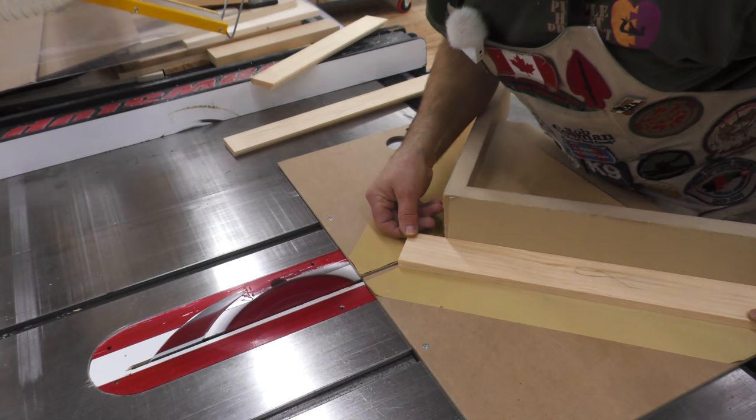Now, I didn't heat up my iron, but I'll get my iron out, heat it up, put a cloth over that, and I'll show you how we can just clean that off. Never know it was there. Okay, I got my iron on hot. That's soaked for probably 10 minutes. I just put a piece of white paper towel over it. This is mostly just to dry it out, because I think it's already raised up above the surface.